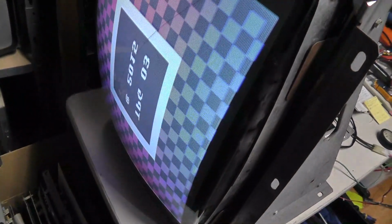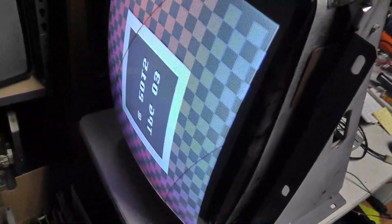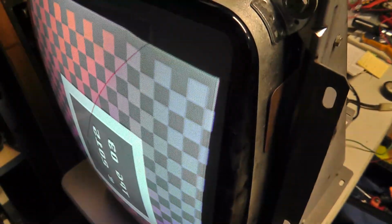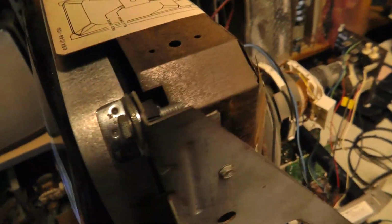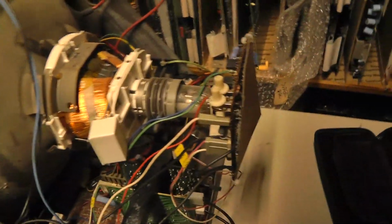Alright, we'll definitely have some degaussing issue or something, at least, but I do have a picture. Brightness is a little high. I can control focus. The brightness pot on this 4600 I have to get to. So anyway, that's what it looks like. It's kind of red, definitely too bright right now. So let me adjust it, and I have to refamiliarize myself with all the controls and everything.